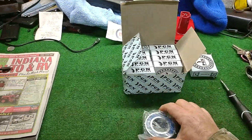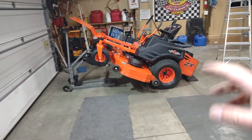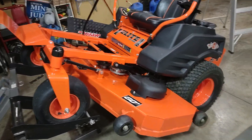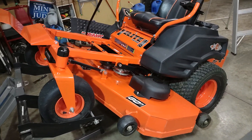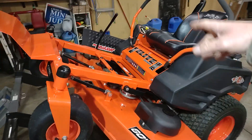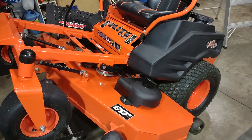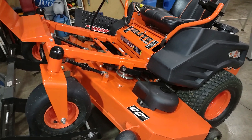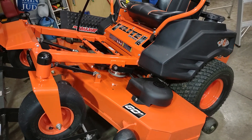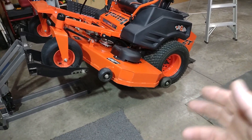This way you don't have issues with your mower housings — otherwise you might have to replace them every 300 to 400 hours. The dealer wants to sell you the whole assembly, which I think used to run around $100–$125 each, so you're looking at $350–$375 for a full set of three. Putting your own grease zerks in saves a lot of money.